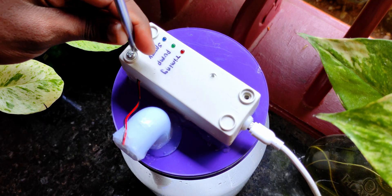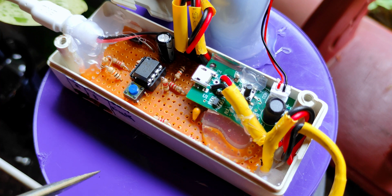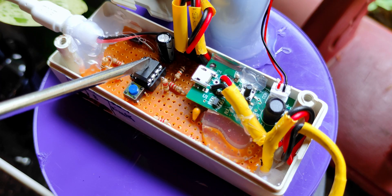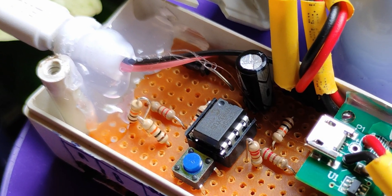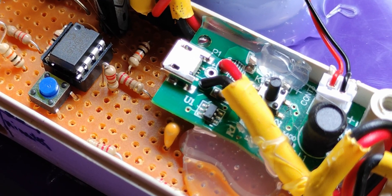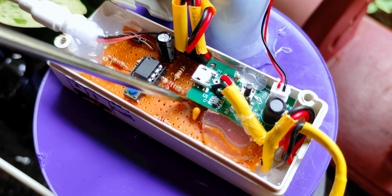I know you were wondering about what's inside, so let's break it down. This is a control system I made, based on a PIC12LF508 — it's a baseline microcontroller from Microchip and one of the cheapest micros available at my nearest store. I used a 5-volt humidifier USB spray module for the spray, and two MOSFETs to control the spray module and the pump as per the control signals from the microcontroller. The MOSFETs are SMD-type AO3402, on the bottom of the PCB.